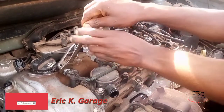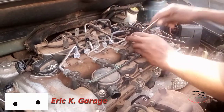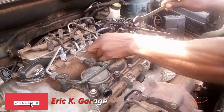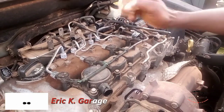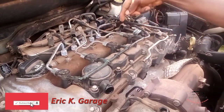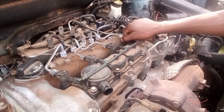Step one: you open them down, loosen the nuts like this. Pin them down. Then someone will crank the engine — it will not spark but it will crank. You'll see the diesel fuel shooting out from the nuts, one by one. If it's shooting out, that means it's running through.